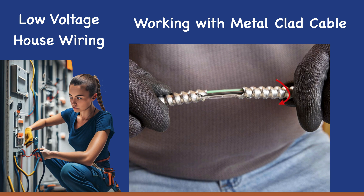When removing a section of armor to expose the wires, twist the short end of cable counterclockwise as you pull the cable apart. If it feels like it's taking too much pressure to separate, double-check that the cut went all the way through the armor. Don't pull too hard, or the armor could separate farther down the line.